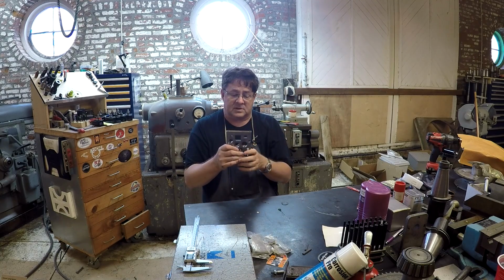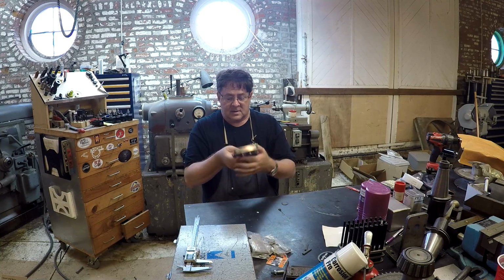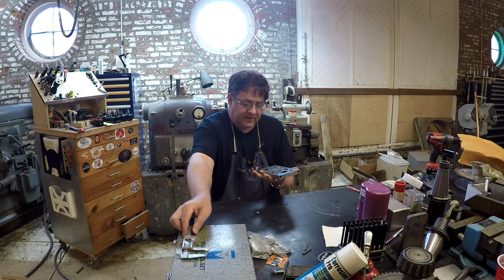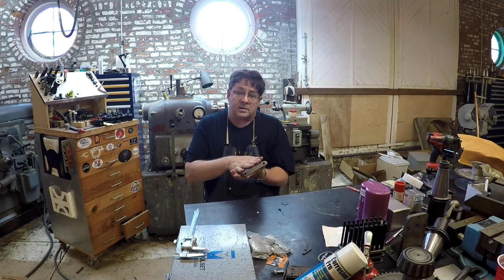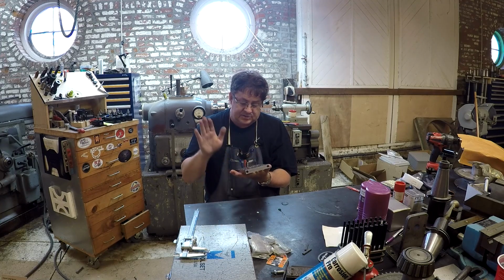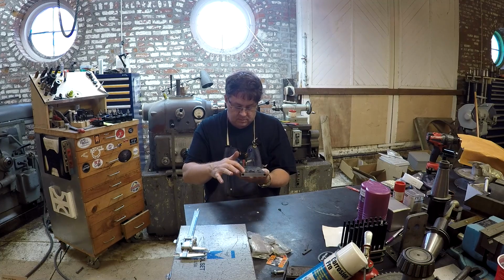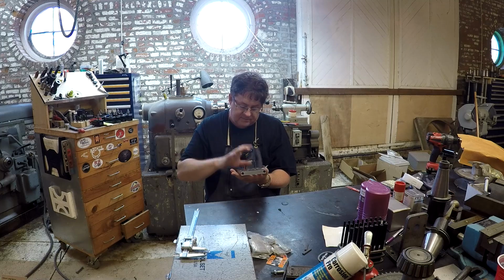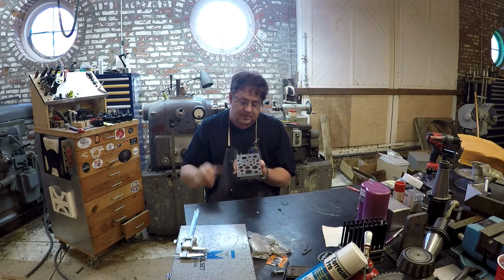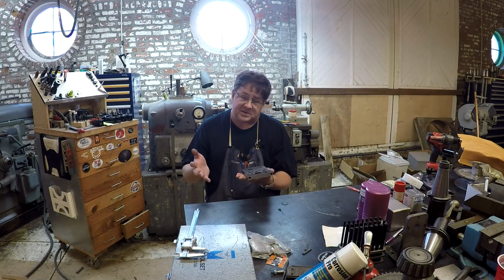I'm assuming he could have been a she, certainly. There are square notches cut in the end here, and then there's a plate bolted to the end of the block. The whole thing is 5/8 of an inch thick. It's hard on all surfaces. It was surface ground on all surfaces, and it has all sorts of holes in it. For the square holes, there's 1/8, 1/4, 3/8, half, 5/8, 3/4, and 1 inch. And then on just the regular round holes here, there's all sorts of sizes in here. Not all of them are ones where you would measure and say, oh yeah, 5/16, right?